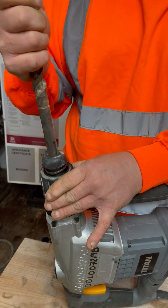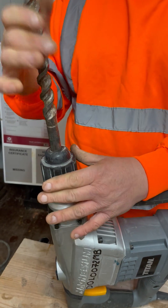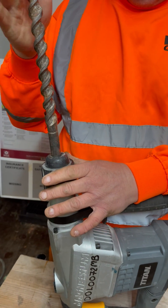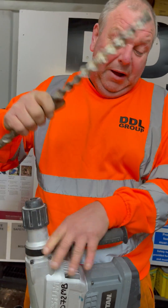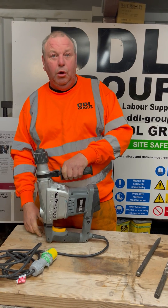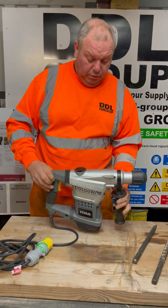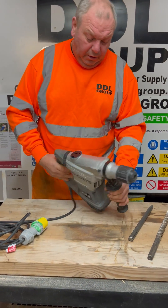Turn it around, all okay, and drop down. This will take a lot bigger steels and has a lot more punch. It'll handle a reasonable size thickness of concrete - if you've got concrete to do, or drilling up to around 30-odd millimetre drill bits on this particular model.